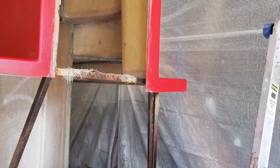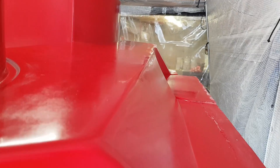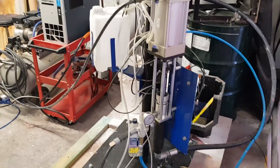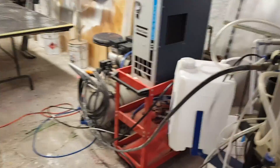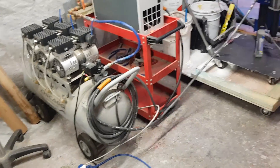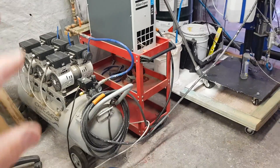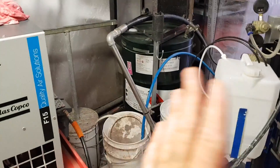Very well prepared for this layup. It's getting up to around 28 degrees ambient temperature at the moment. I've moved my compressor, my air dryer, and my machine all in line so I can get to every part of it. I've just drained my compressor — that's a pretty important thing when you're using a compressor. I drain it every single day. When you're compressing air you're going to collect a lot of water in there, so you make sure that's bone dry. That starts with a reasonably dry air stream into my air dryer and then follows onto my machine. I've got a bucket of acetone here and I've been soaking this machine — it is all clean.